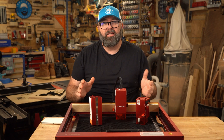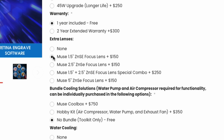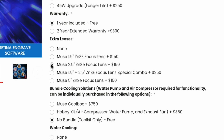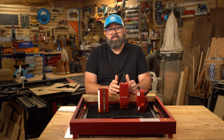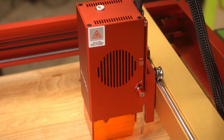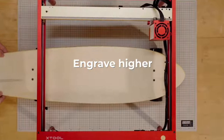Either way, from a speed perspective it's comparable to a CO2. CO2 lasers typically come with a two inch focal lens, which is a good all-around lens for engraving and cutting. Decreasing the focal length to one and a half inches will allow you to engrave finer text, and increasing to a two and a half or five inch focal length will allow you to cut thicker materials. If you increase your focal distance, you'll lose your Z height, so make sure your machine has a removable bed if you want to engrave thicker materials. On the diode laser, your focal distance is what it is — there is an adjustment on the 40 watt diode to cut deeper into the material, but you're not going to be changing out the lens for a different focal length.